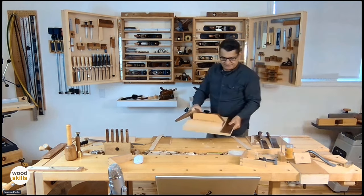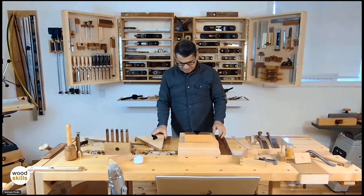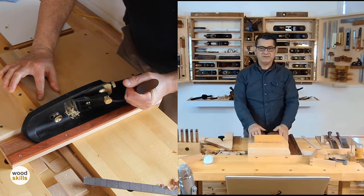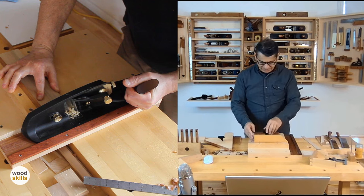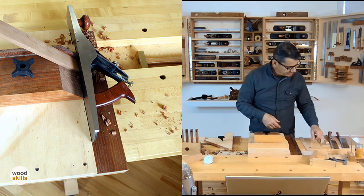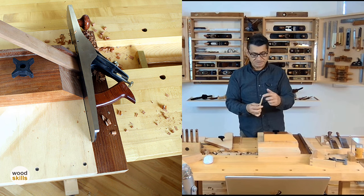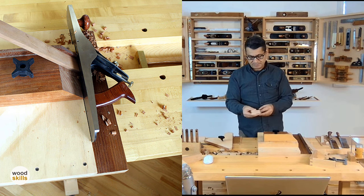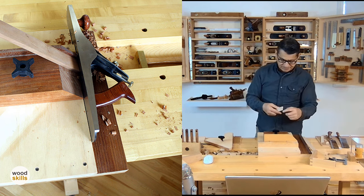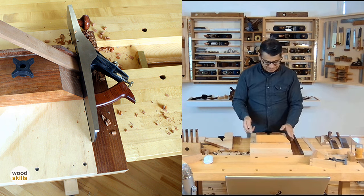This is my most recent go-to shooting board, and I'll tell you what I've done with this. This is actually one of the original shooting boards with left-hand orientation that I created for that Fine Woodworking article way back when. And this attachment does case miters. So this is an example of a case miter. This is 45 degrees, so this would be a small compartment, a box, a drawer. It's important to have the corners at 45 degrees, and that's accomplished through this attachment.